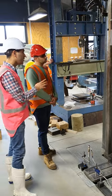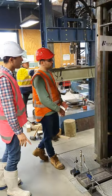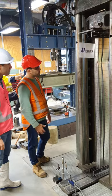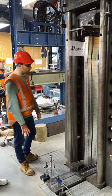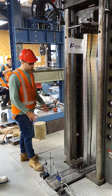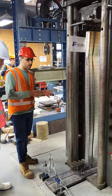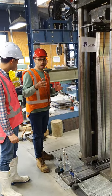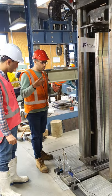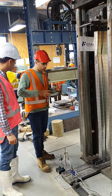Puyo, what do we expect to get out of these tests? Well, in this test we are applying the compression force in the column, measuring the displacement and the force in the column — trying to find out what is the capacity of these columns and comparing with the standard formulas that are in the codes, and comparing how different we are.